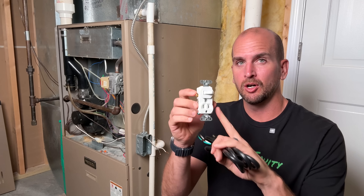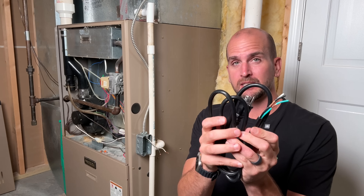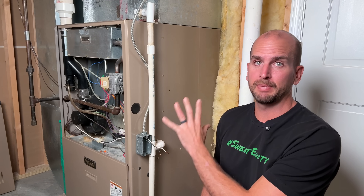Now we're ready to install our switch-outlet combo, and there is one small detail you do not want to forget or it'll trip you up. We'll also install an extension cord — basically feeding it to the furnace. It's a six-foot, 14-gauge extension cord, and you'll see links in the description below for all the supplies and tools we're using today. Once we have everything plugged in, we'll actually measure the power so we know what kind of power we need to deliver to run this appliance, and if we're using a battery setup, how long it would run — so you can make the appropriate plans for your own home.